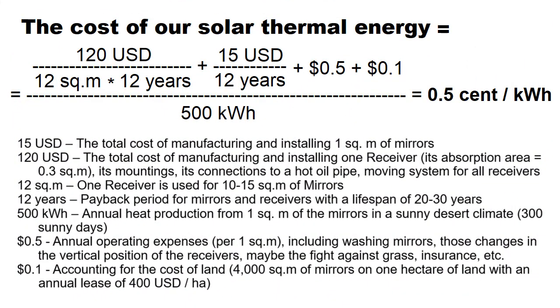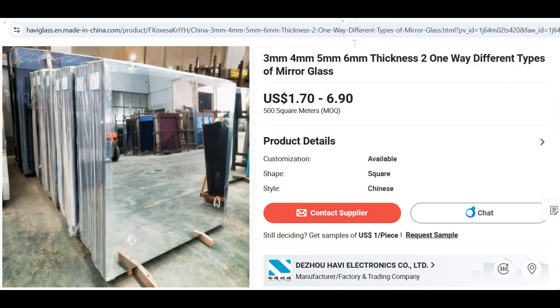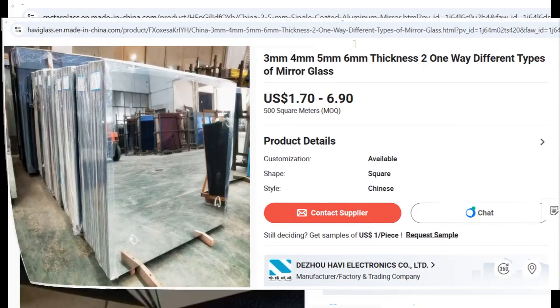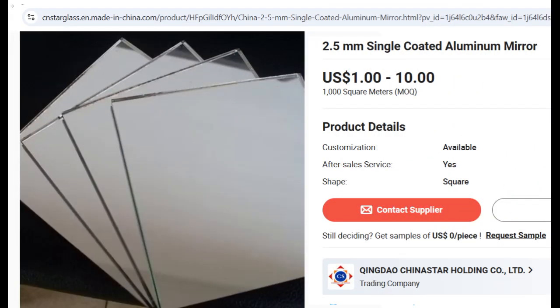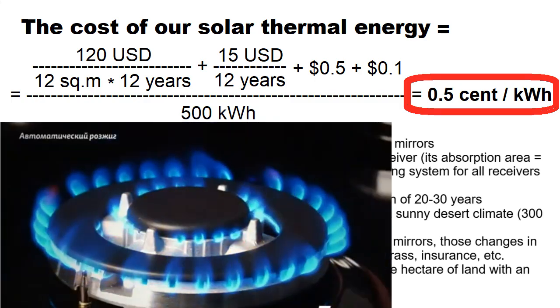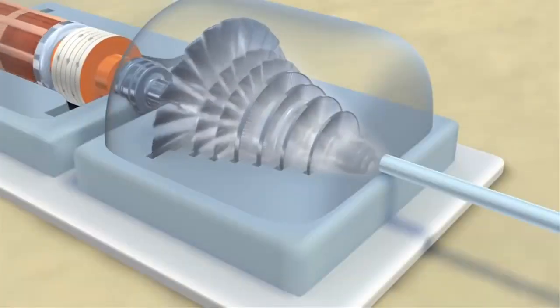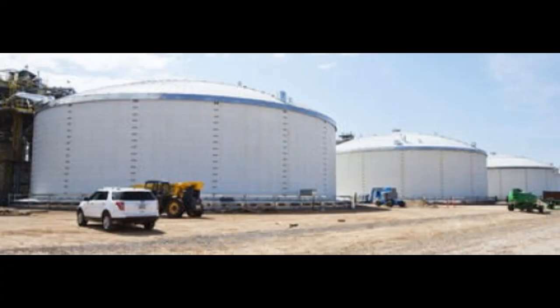This formula describes my goals. For example, the cost of building the mirrors should be around fifteen dollars per square meter — this is realistic because wholesale prices for glass mirrors can be less than ten dollars per square meter, especially mirrors with an aluminum reflective layer on thin glass. This leads to a solar heat cost of half a cent per kilowatt hour, almost ten times cheaper than heat from natural gas, and this cheap solar heat can be converted into cheap electricity using turbines and heat storages.